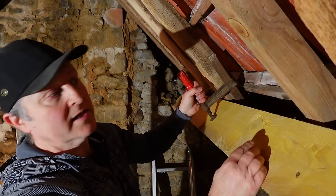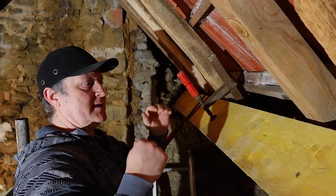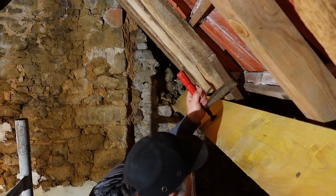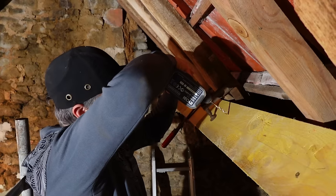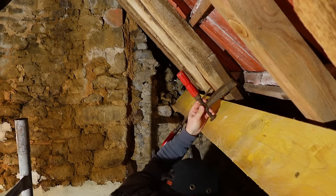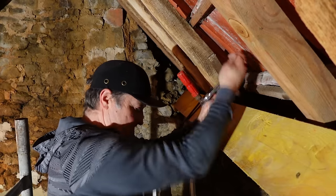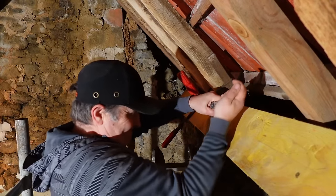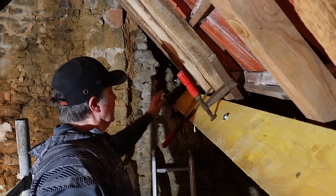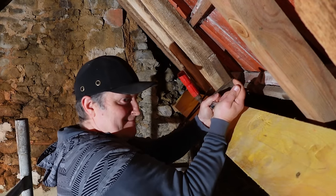Yeah, the more I look on this side, I can see all sorts of snapped battens that the tiles are sitting on, where the rafters have slowly sagged, and of course there's no strength really in the battens and they just go. Okay, let's clamp down. Quick drill. That's it. Just touching that in now so it's nice and firm against the old purlin. Another fixing. I'm laughing.